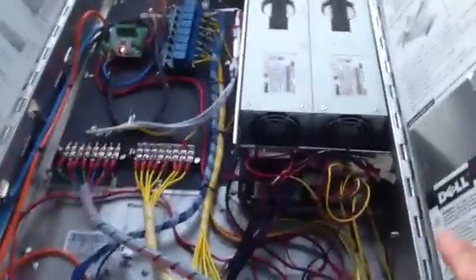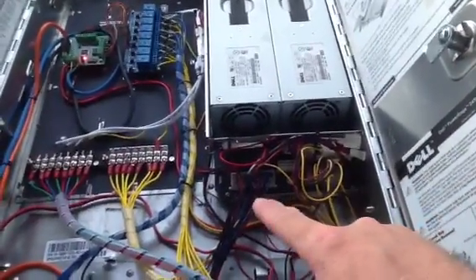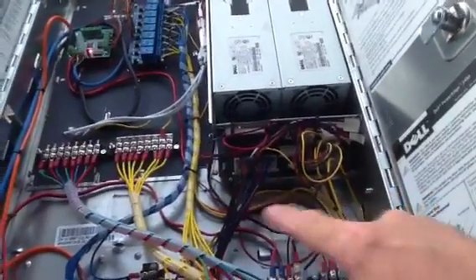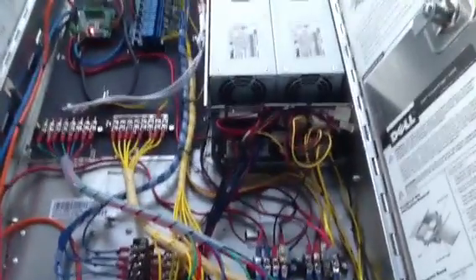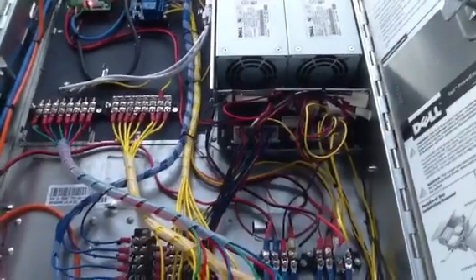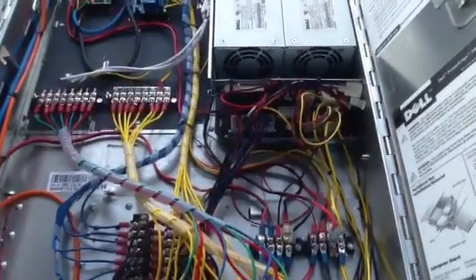I also modified all of the redundant power supplies, the output boards and cables. I simply cut them off and using my multimeter tested all the voltages. Do not go by standard ATX pinouts or colors. If you decide to do this, test with the meter for voltages, especially with Dell — the colors do not match the standard ATX color scheme.